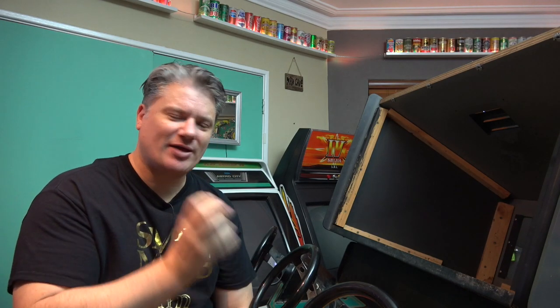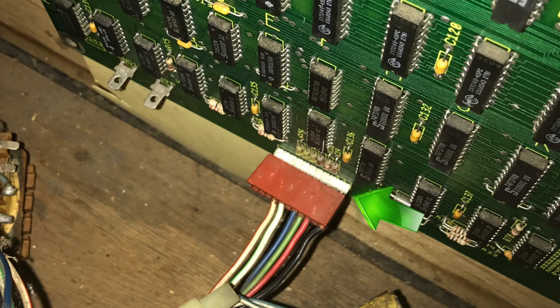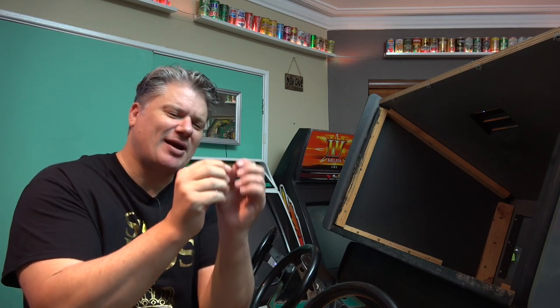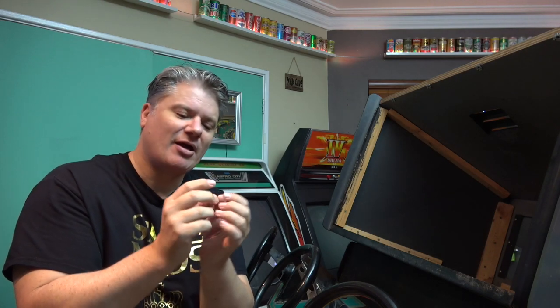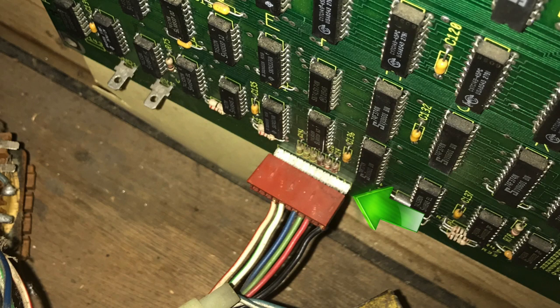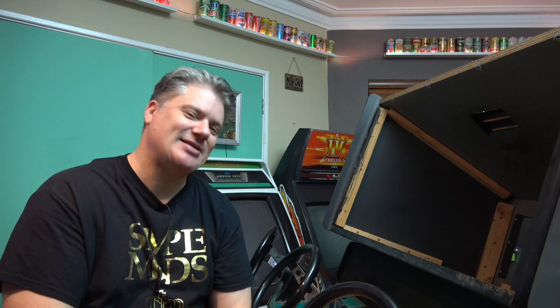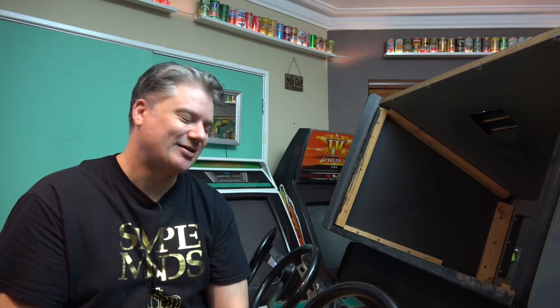When putting the neckboard back on the monitor tube, I noticed a strange plastic ridge on the back — it looked like part of a neck from another monitor that had broken off and stuck there. This meant the neckboard wasn't fully seated on the monitor pins. I removed all that excess plastic and got the neckboard flush. I also found the RGB connector from the game board had a keyed hole with a plastic insert sticking out, so the whole connector wasn't flush against the board. I fixed that too, but after turning it on — still no red.